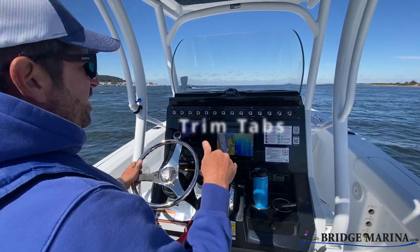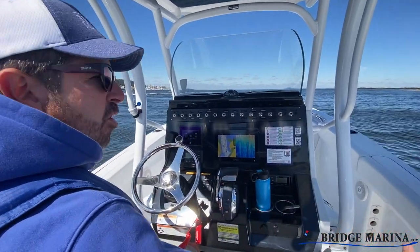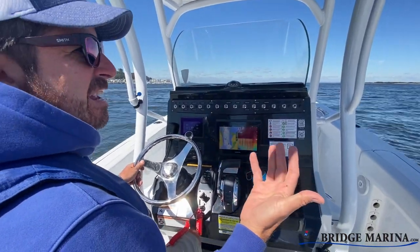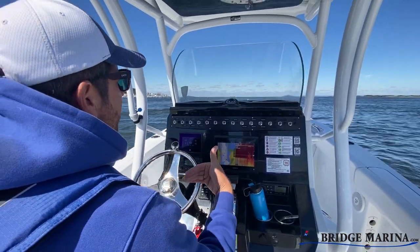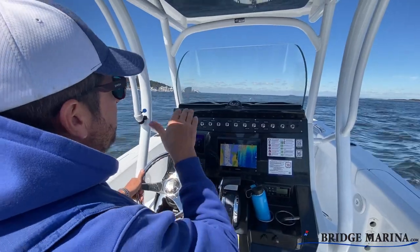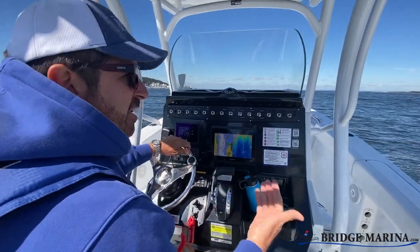I'm going to keep going up and I've got this thing trimmed down so you can see the bow rise a little bit. It's certainly starting to plow because I'm starting to push the water out to the side. We're running around 12 miles an hour — probably more like eight — I just happen to have current with me. I have it trimmed down so as I advance into that plowing or maximum displacement mode, we can see the bow come up. I'm producing a pretty large wave right now and it's just going to keep getting larger.